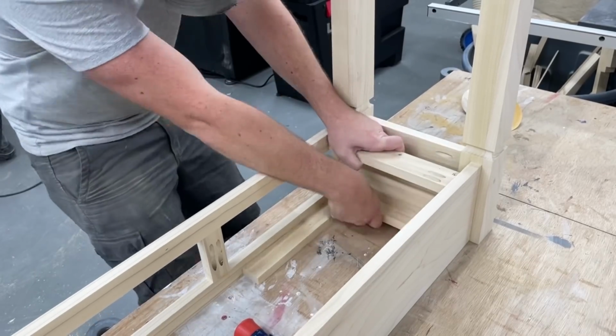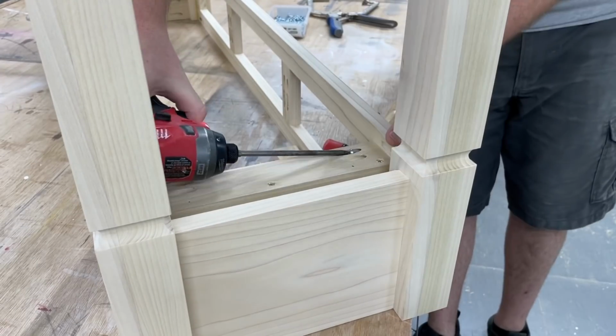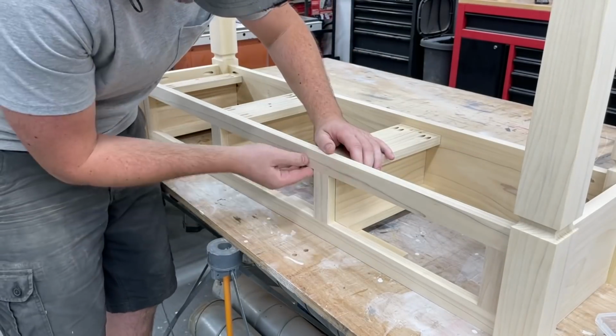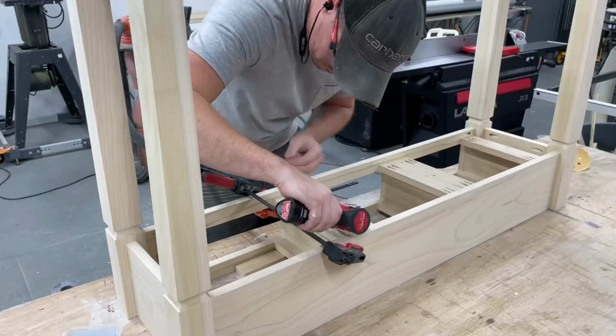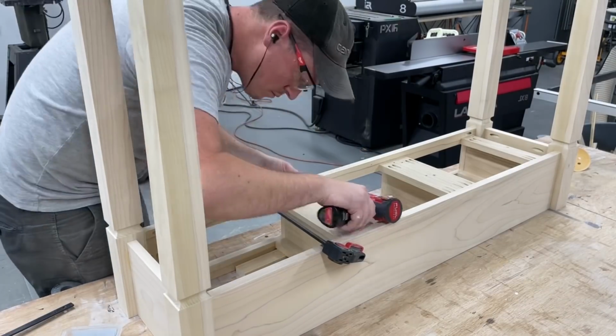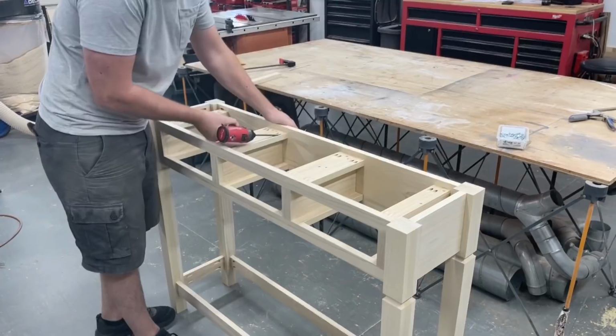And you can see I drilled pocket holes on the tops and bottoms to install them so they wouldn't be seen at the end. After getting the runner slid into place, you can see the U shape is flush on the inside of the face frame on all 3 sides. These runners also had the unintended benefit of really solidifying the whole table and eliminating any racking.